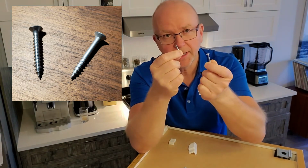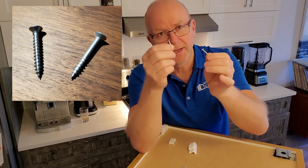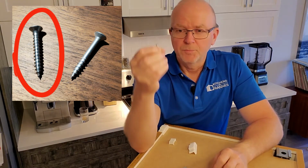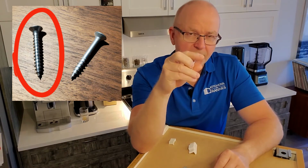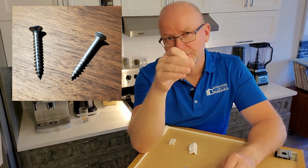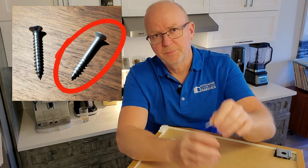I always use a clamp. I'm very meticulous. I line up and I adjust, and then I put in a screw, and I even pre-drill. And with this one, I pre-drill just so my drill is poking a hole in the second layer, because if I don't do so, sometimes the two layers, the two cabinet gables, can move away a bit from each other.